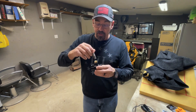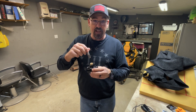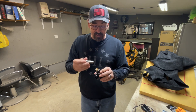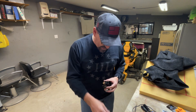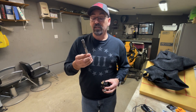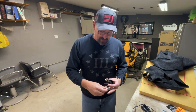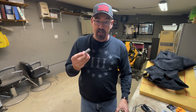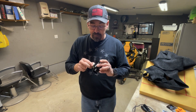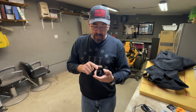And what you do is you'll tap this out. When you're tapping this out, you better put lots of oil and lots of elbow grease too. Use some kind of cheater pipe because this thing is tough cutting. I started my hole with a nine-sixteenths bit, and I was able to tap it with that, but it took a lot of elbow grease — it was tough. I was very careful; I kept spraying it to keep it from overheating and cracking this. You don't want to crack it.